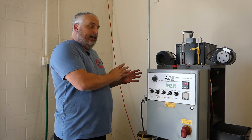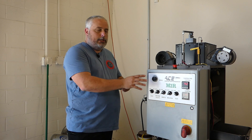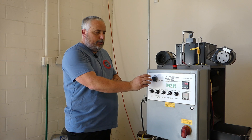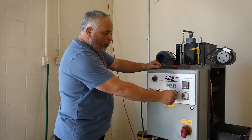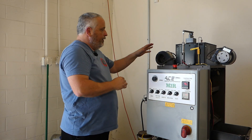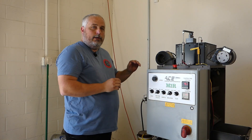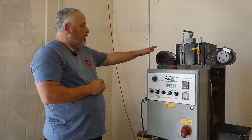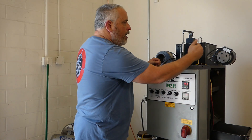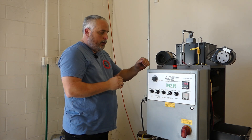If you've got a bullet that needs a lower speed, it's a very simple adjustment. You'll get used to what bullet you're running and what lead you're running. You can turn one fan on or both fans on — it's up to you. So you've got one fan here and one fan here. This one is cooling the sprues so that the lead solidifies and breaks off faster.